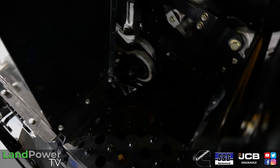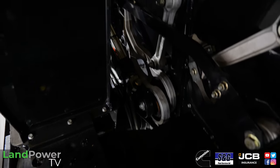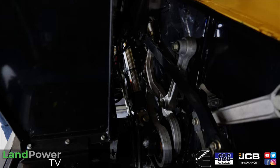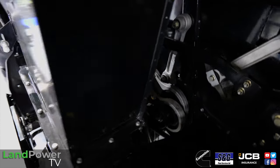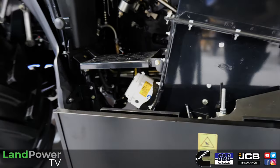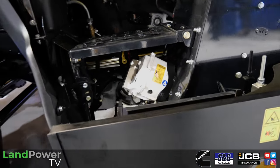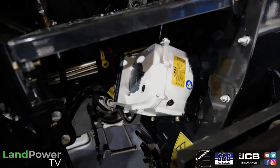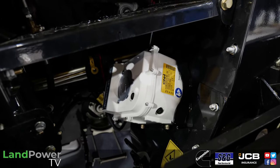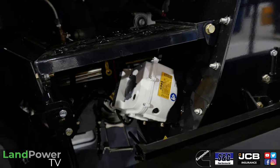One thing on this that is optional, but we're getting a lot of chatter about it at the moment, is this NIR sensor, near infrared, at the back. So similar to what you've got in your forage? Identical system. That box can actually swap between the combine and the forager. You can go onto a slurry tanker, so that you can measure nitrogen.